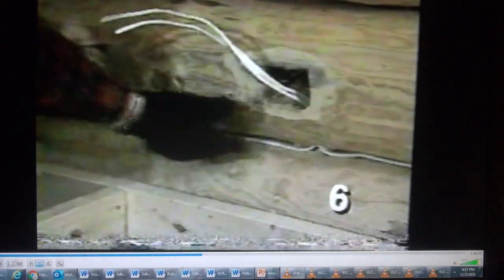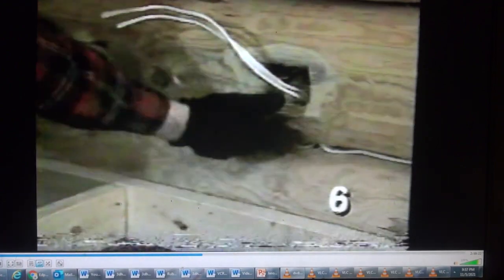The electrician has also taken advantage of the floor system to run all of his wires. Now that the exterior chinking has been applied, he's run some of his wires in between the logs — this will form a receptacle right here. Later on, the interior chinking will cover up the exposed wires. That should give you a pretty good idea of how we work with built-up flooring to hide mechanical systems.